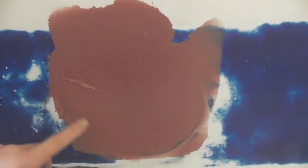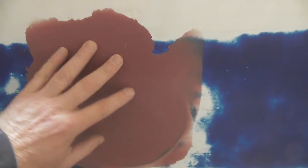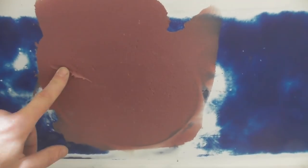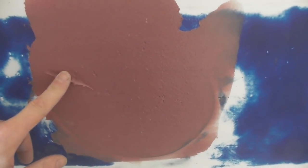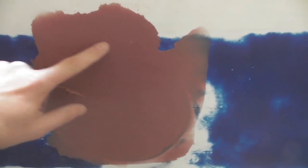Well, this is a thru-hole that I closed up and I put some skimming material on it the other day, some fairing compound. This is the 407 low density filler. There's a bit of a nick here where I dragged an extension cord over it the other day as it was setting, so that's a bit of a bugger, but that'll need some work. I might need to put a second skim on this, but anyway, let's see how we go.